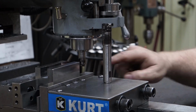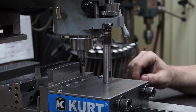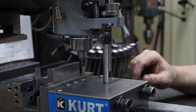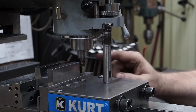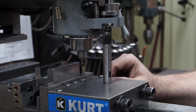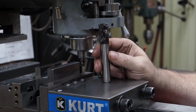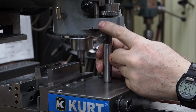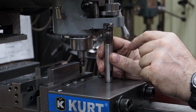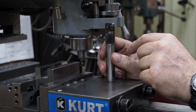And channel cutting, this is what I'm doing when we're cutting down the middle. That's referred to as channel cutting. That's really hard on your end mills, and I got a little technique that I use in this case. I'm using indexable inserts with a Dijet. People familiar with Dijet, they'll know they're awesome cutters. This one, the inserts are beat up a little bit. I was cutting semi-hard steel with it, and that's where it really comes out good.